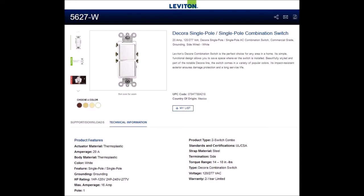I asked what the 20 amps stands for and they did not have an answer for that. So I believe the technical person is wrong on this. The reason I say that is that the 16 amp rating happens to be for a one horsepower motor — they're saying one of the switches is rated for one horsepower or 16 amps. It has nothing to do with the device rating.